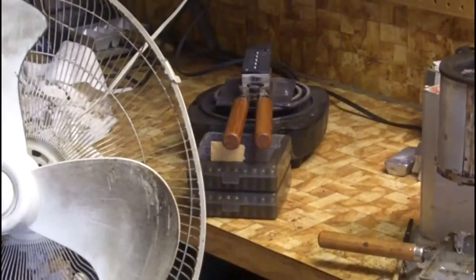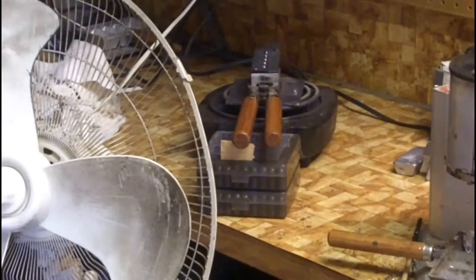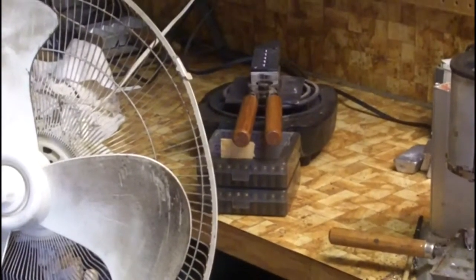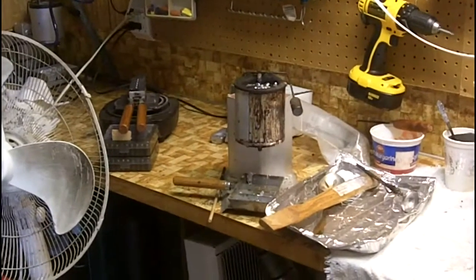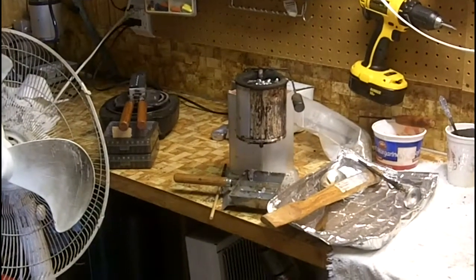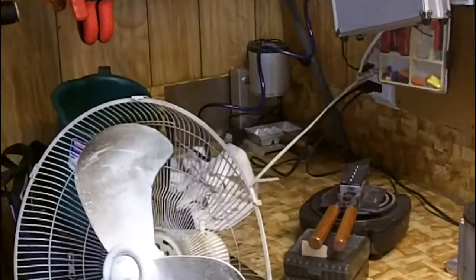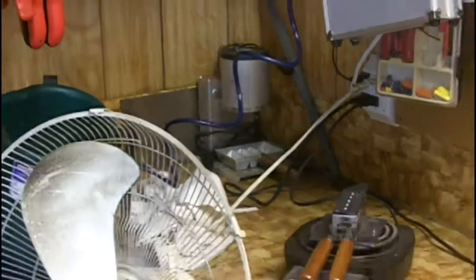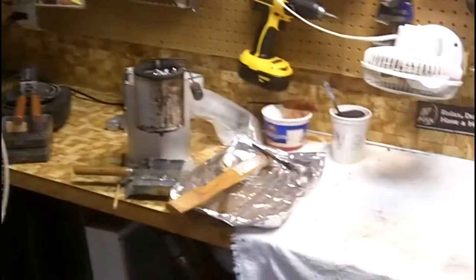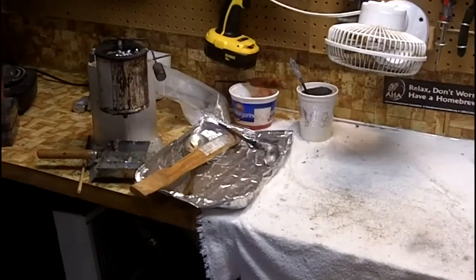I use a hot plate to warm up my molds. This is my 92 grain NOE mold I just got yesterday. This is a 10 pound lead pot — when I'm casting small 9 millimeter bullets I only use one 10 pound pot, but in the back I've got another 10 pounder for when I do my big 40 cal bullets. I have a little metal tray to catch all my sprues.